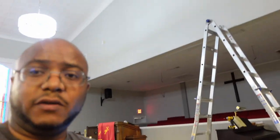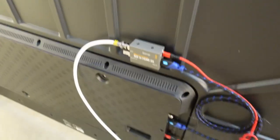What I did is we changed out the plate up there to just a single BNC. I have everything set up behind this TV. I am running a test SDI cable right now just to hook to that jack. Then I need to go behind the wall and do the same thing — terminate that with a BNC, connect it, put a signal through, and try to find where that is going. I may have to terminate four of the cables just to get this first image. Once I get one, I'll know the flow and we can go from there.